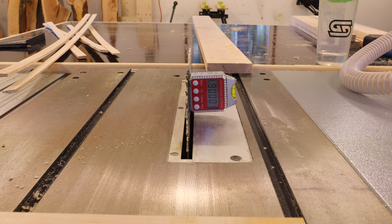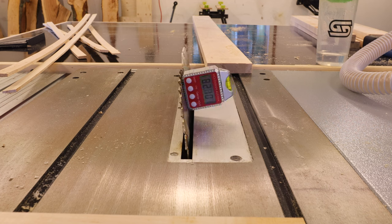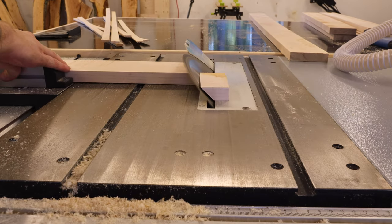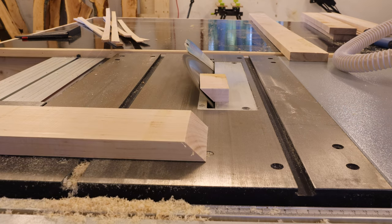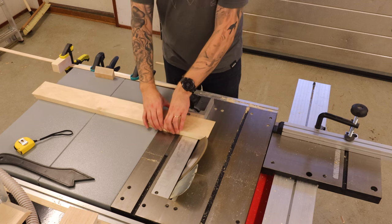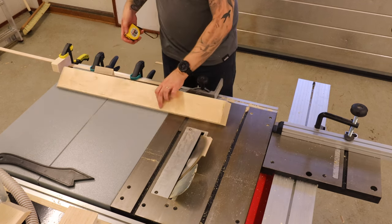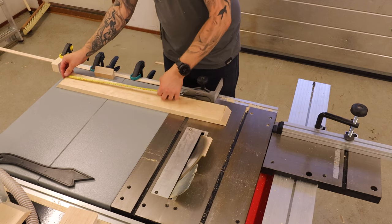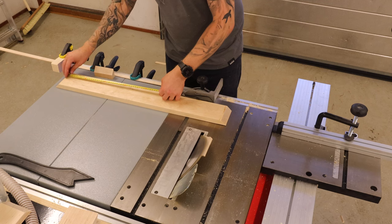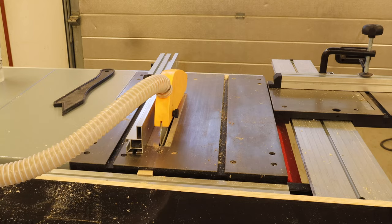This would be easier to do with a miter saw, but as I don't have one yet I will be just using the table saw to make the cuts. I started by setting the blade to a 45-degree angle and then cutting one end from the board. Then to do the cut on the other side, as the table isn't wide enough and I wasn't able to use the saw's own fence, I had to attach a strip of wood to the table and then attach another piece to act as a stop block for me to do the cut.